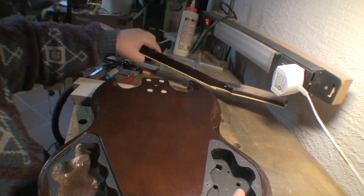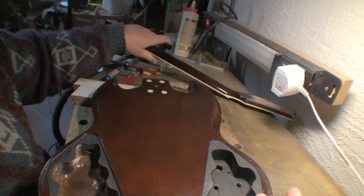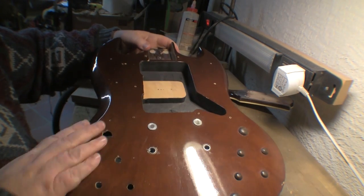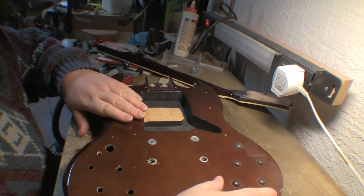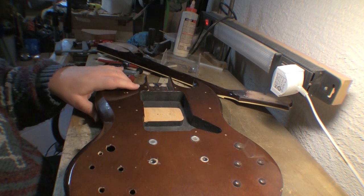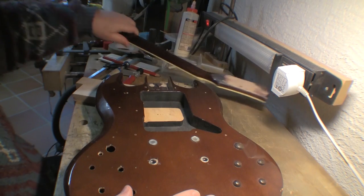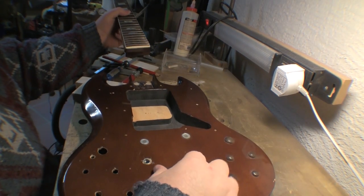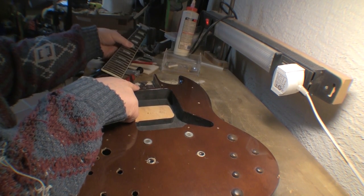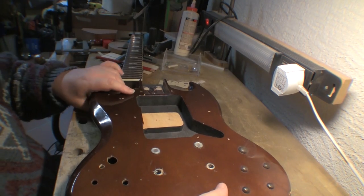Whereas in the past I enjoy making guitar necks because it involves a lot of carving, making something like an SG body is pretty basic stuff — it's a flat slab of wood with a couple of chamfers cut on it. So rather than make one from scratch, I just went out and bought a blank — or an almost-blank. The other challenge is I couldn't find anywhere online a body blank for a bolt-on neck like this one is; I could only find one for a glue-in neck. So part of the challenge will be how to modify the heel of this neck to fit it into a glue-in body.